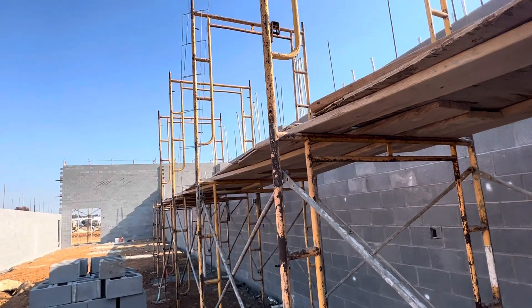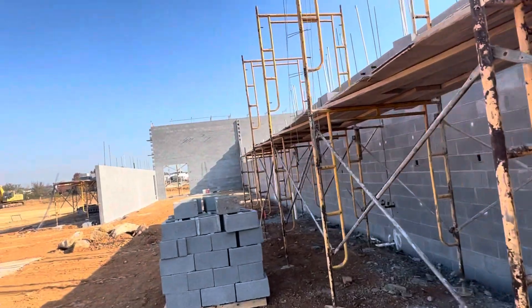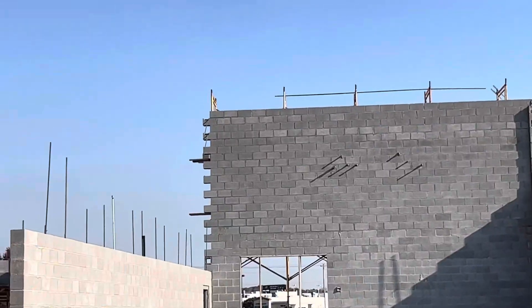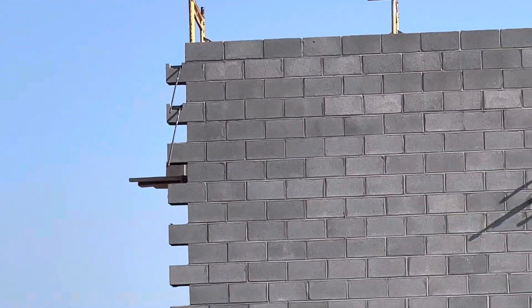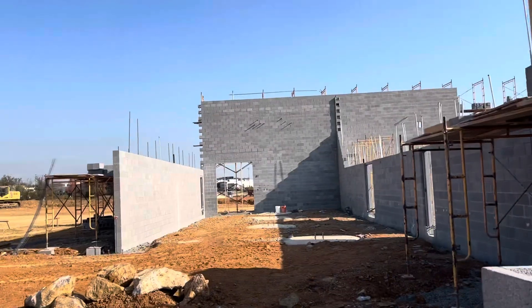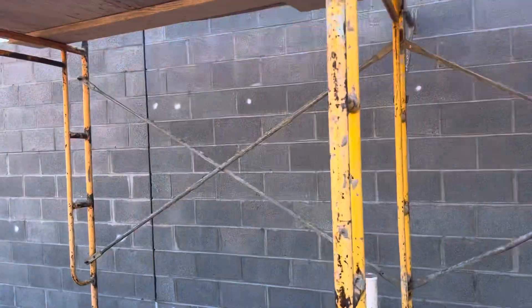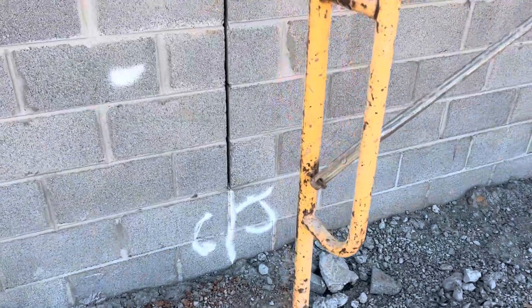As I said, the important thing is the elevation. Over there there's a bond beam, and you can see rebars sticking up — like L-bars — for the bond beam. So when we build that wall we will tie it together. Here again is the expansion joint and the control joint — you can see the side for the control joint.